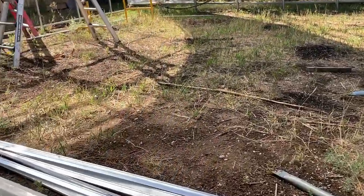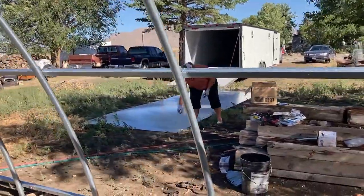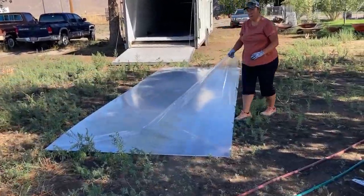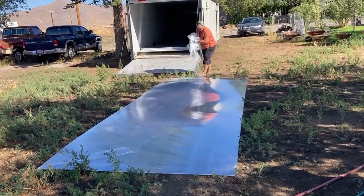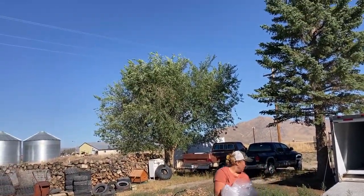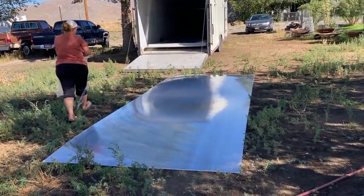Something occasionally forgotten is the protective layer on the backside of the panels. There have been situations where I personally forgot to remove it, and it becomes a real nightmare to try to get it off later. The panel is put into position and you roll it up. If you don't get these panels in before the wind's above seven miles an hour or so, you're in real trouble. The wind's blowing in this direction so we can use it to help push the panel up.